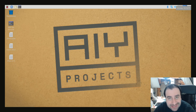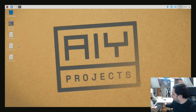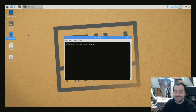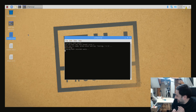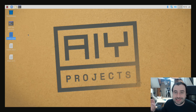We're logged into our Raspberry Pi using the image we just downloaded and installed. The first thing we need to do is check the audio and recording to see if it works. My box is connected to everything — internet connected, powered up. Click on the 'Check Audio' link and double click it. It says 'playing test sound' — I heard it, so it worked. It asked 'did you hear the test sound?' — I typed yes. Now it says press enter and say 'testing one, two, three.' I pressed enter and said testing — it played back loud and clear. Hit Y and press enter, then press enter to close. We just tested the audio speakers and the microphone — they all work fine.